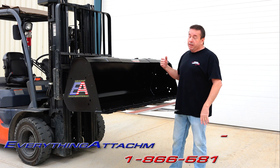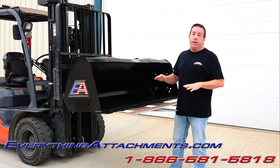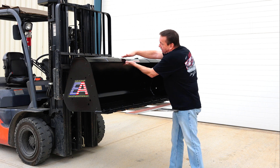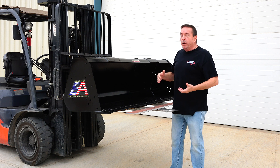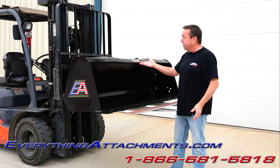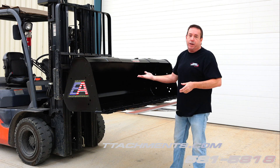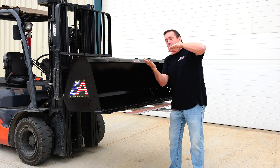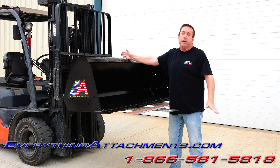Tell your dealer to leave his bucket there. All the factory buckets — our Kubota buckets and the others — all this area here uses mild steel, and that area is being used to strengthen the bucket. We don't have to do that with hard-ox, so instead of wasting that space just to keep it from bending, when you heap this bucket it gives you a lot more volume. And when you roll it back, it works like a cup and rolls your pile back up against the bucket instead of onto the hood of your tractor. Factory buckets are getting worse every day.